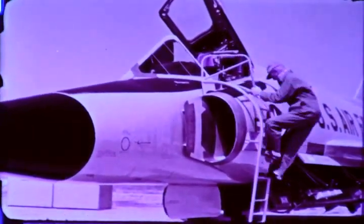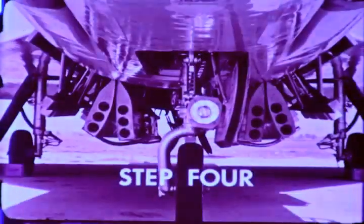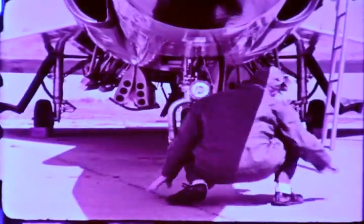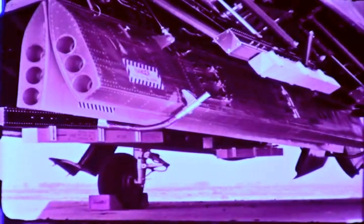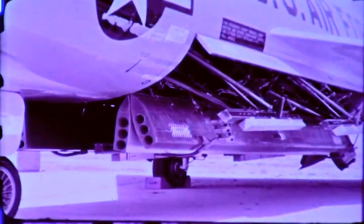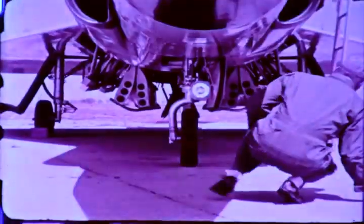The fourth step is a visual check. Place yourself in such a position that you can see all the launchers and all the doors. Since each selector valve controls either three launchers or all the doors, the three forward launchers should be in the same position. The three aft launchers should be in the same position, either up or down. The bay doors should be all open or all closed. This makes it possible to apply pressure to the pistons for snubbing.